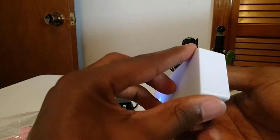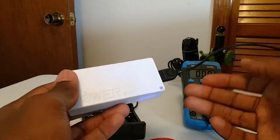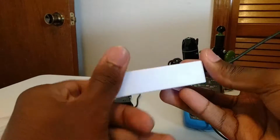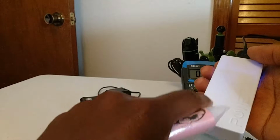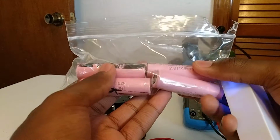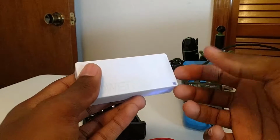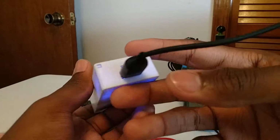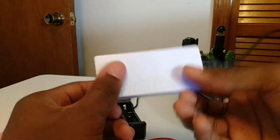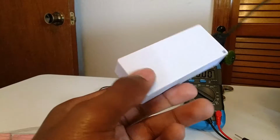Like I said, it depends on the capacity of the cells you get. The one I have is smaller than my phone battery, not by much, but it's not going to fully recharge a smartphone, though it should charge it a little bit. You can get bigger capacity cells, and this does support up to 2 18650 cells, so if you had another 2200 milliamp hour cell, you could put in 2, and that'd be roughly 4000 milliamp hours. For most iPhones, and it gets pretty vague, Samsung flagships, that should be a full recharge, but I wouldn't have a problem with some smartphones nowadays. It's nice to have.